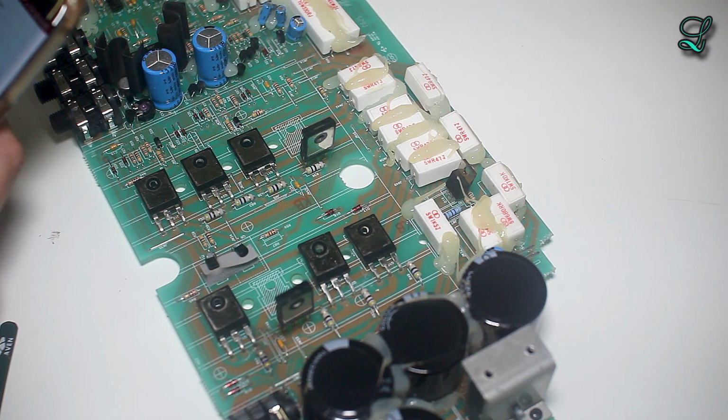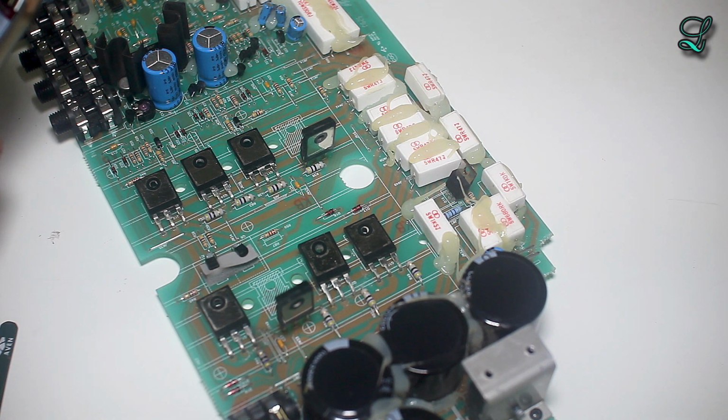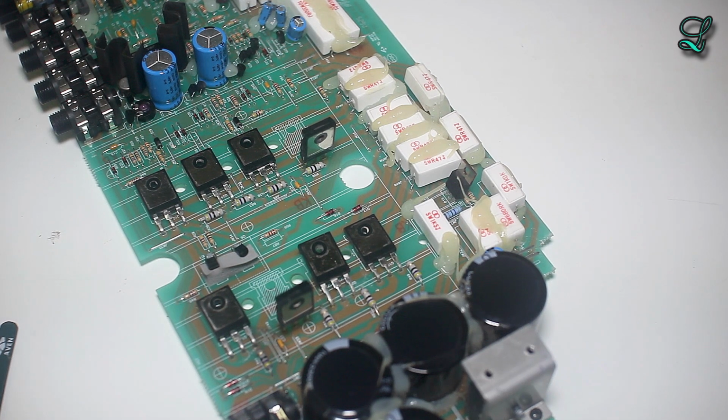It's rated at 3.1 amps collector current. The VCE saturation voltage, 1.2 volts. That's a junction temperature. I was going to say it was pretty impressive. The operating temperature says minus 65 to 150 degrees C. That'd be phenomenal, but it says junction temperature, so it's not what the package temperature would be. Okay. Well, it's a BJT.